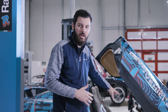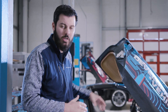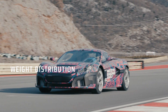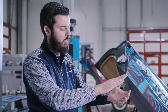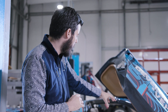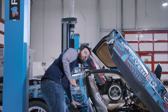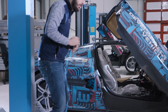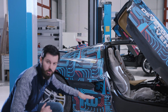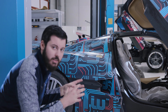We have part of the battery pack in the foot area, so there are some battery modules under the foot, because we wanted to have more weight in the front so that when the car accelerates and the weight gets transferred to the rear, we have grip for the front powertrain to achieve maximum acceleration. We have a battery pack in the tunnel area of the car and behind the seats, but still very low, so the center of gravity is actually somewhere around the wheel axle — an extremely low center of gravity — and all the main components are inside the monocoque.